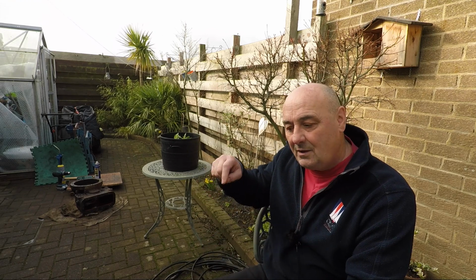I'm expecting to have to drill these out right till it just touches the thread in the casting, and then we're going to have to try and either knock the remaining metal out, or go in with a tap and try and clean it out. Either way, it's going to be fun today, isn't it?